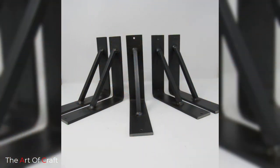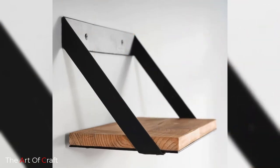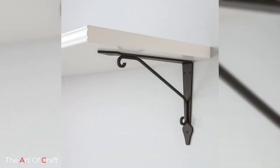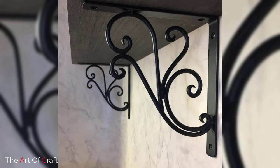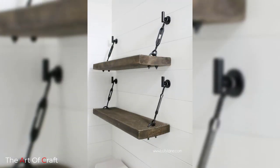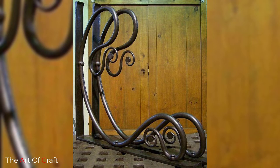Be sure to check the weight load and size of the rustic shelf bracket. When using shelf brackets in the kitchen or dining room, a good depth for shelves is 12 inches. You can find farmhouse shelf brackets in practically any size, but you want them to span more than half of the depth of the shelf itself — ideally the full depth. You also want to check the weight load, which will depend on what you plan to use the shelves for. If you plan to put dishes or anything fragile, make sure they have a heavy load rating. Most shelves will have a load rating by pounds, and you can then decide how many brackets you need to carry the desired load.